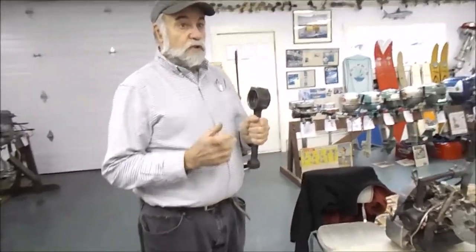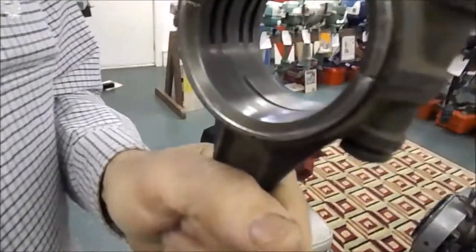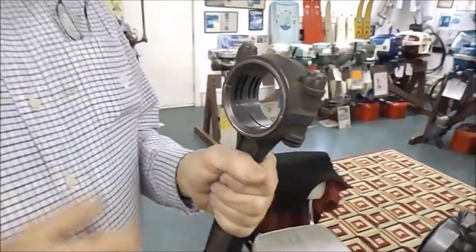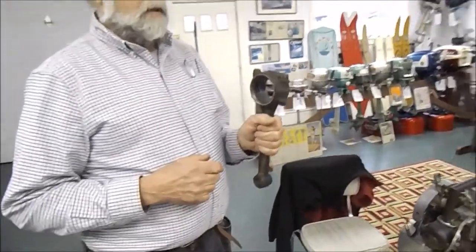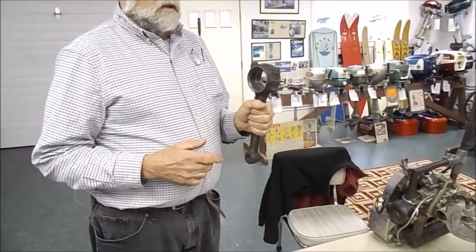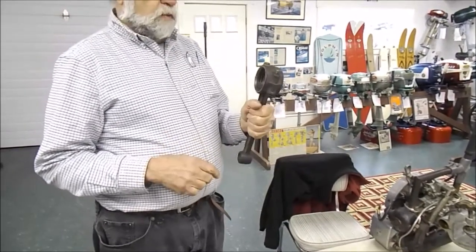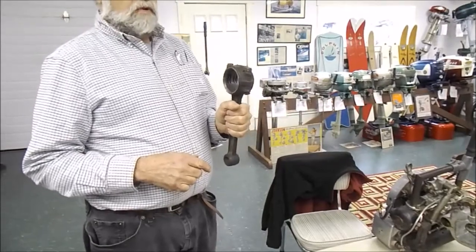The technology of the day was soft Babbitt bearings and a soft steel crankshaft. With good lubrication, that was kind of a forever situation. The only failures would happen due to dirt or incomplete lubrication. It's actually quite a nice system — a hydraulic bearing, one without rollers, not a ball bearing.